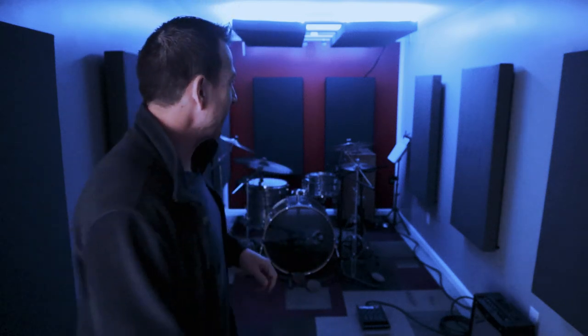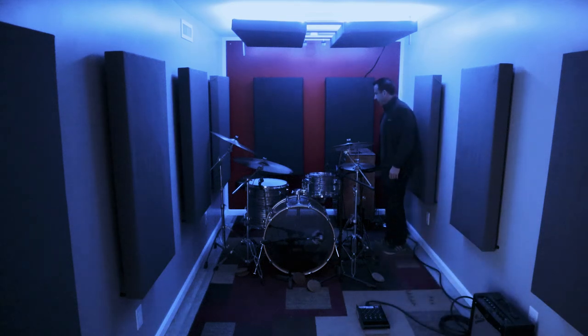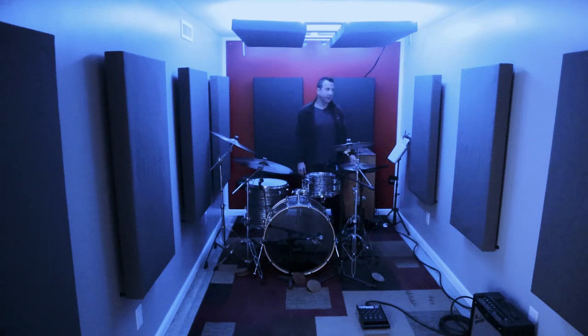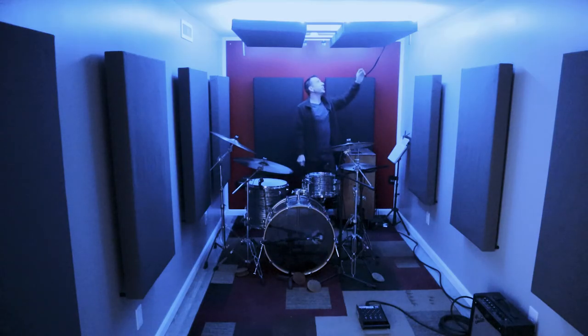So let's go dark again, and let's do this one. Okay, so you got a little bit of vibe there. Back here, I put in a ceiling outlet; my intent was to put in track lighting. Here I have a ceiling cloud. The purpose of this ceiling cloud is acoustic treatment. It helps absorb flutter echo, and this setup also helps with the bass response. I also use this to mount my overheads for my drums. But I also put in some strip LED type lighting.